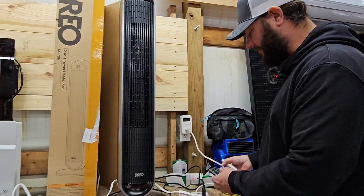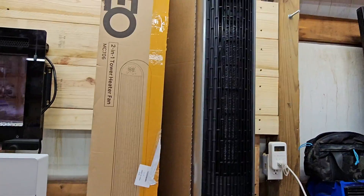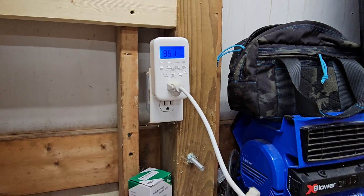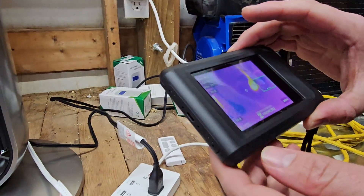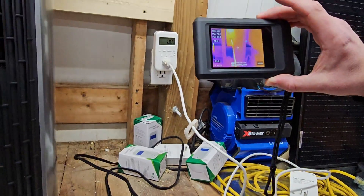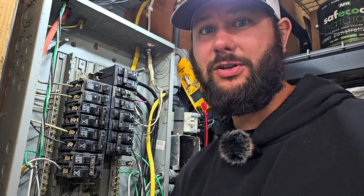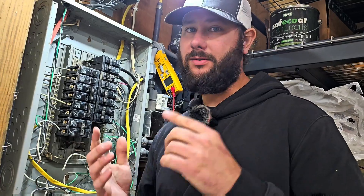Let's see what happens when we plug both heaters into a power strip. They're plugged in and on. Now let's turn them both on. The wattage is climbing — 800, now 2000 watts. Let's see if our thermal imaging camera is picking anything up. The core is getting hot — and look, it just clicked off. Now let's check the breaker: the breaker is still on, it did not trip. We were over 2000 watts and the power strip actually turned off. That's pretty nice — but not all power strips will turn off, so don't trust your power strip.